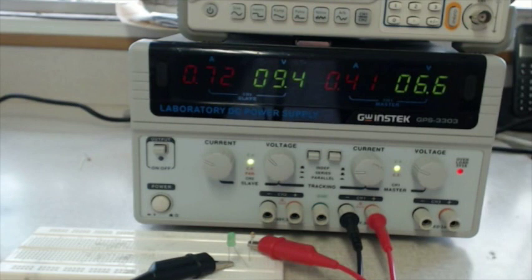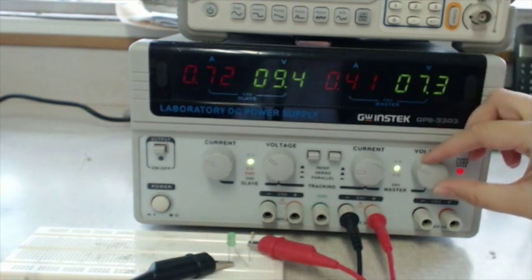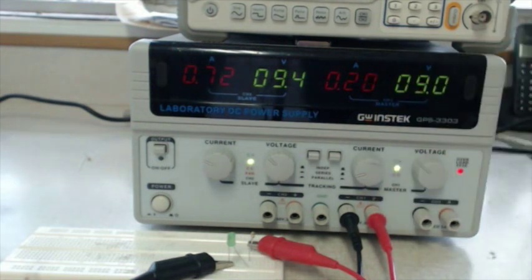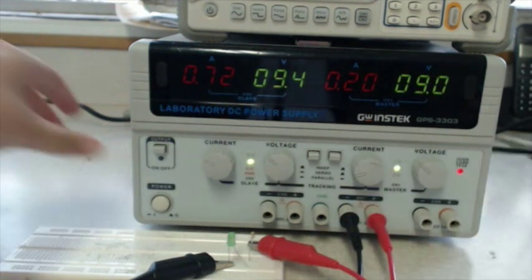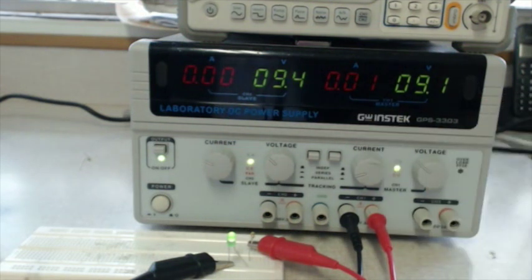Now that we have connected our supply leads to the power supply, we can connect them to the circuit as well. We also need to adjust the voltage, so I am adjusting the voltage knob to get the voltage up to 9 volts, which is what we are looking for. I am also going to adjust the current limiter to 200 milliamps or roundabout — this will show up as 0.2 on the current display. After I have double checked that everything is connected correctly, I can turn on the output. We can see our LED goes on. When switched on, the current display shows approximately how much current is being drawn by the circuit.